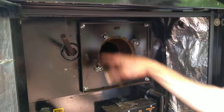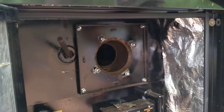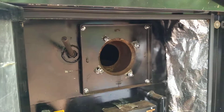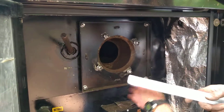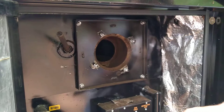Now this whole plate comes off. I usually, once a year, go back into the area above the turbulators and sweep all that out — I'm not going to show that in this video. But go in there with a shop vac or just a little piece of sheet metal and knock the ash down the tubes. I think you get the idea — it's not critical that it's scoured clean, just that you don't let it build up until it starts blocking airflow.